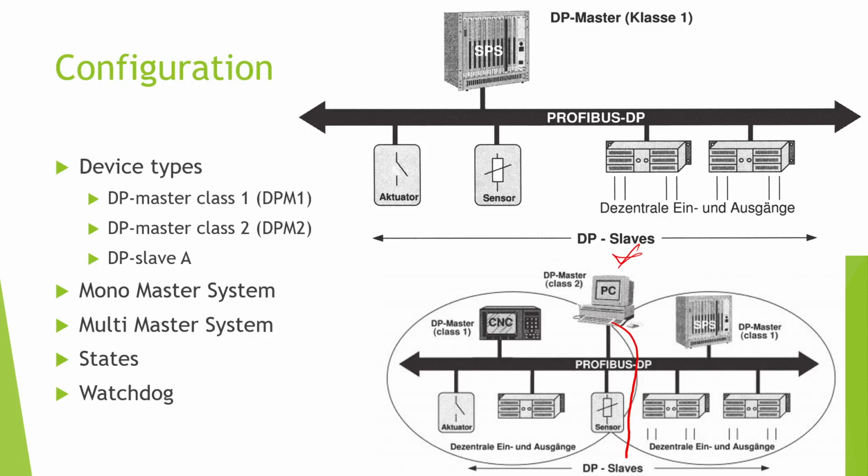But what it can do is when it detects that the system has frozen, it can go, is everything all right? And just kind of wait a few more seconds or whatever the magic time is. And it says, it's not all right. And it can reset things. Now it could reset maybe a specific IO module, like a network one, a remote one, or it could reset maybe the PLC, whatever the case is. So a watchdog is a timer that makes sure everything is operating as it should. If that timer expires, the master is notified and all assigned slave devices enter a fail-safe mode. That's what this is saying, at least.